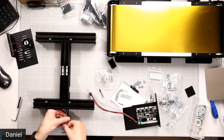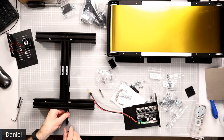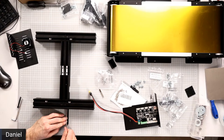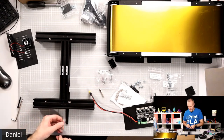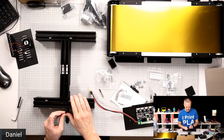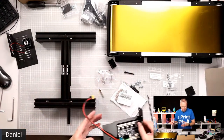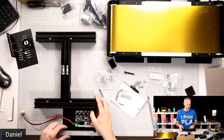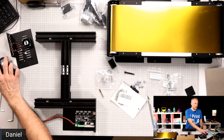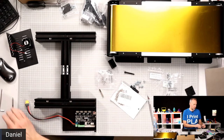And that's why it's important when getting this kit. I never checked every single detail of the Ender 3 versus the Ender 3 Pro, like if every single screw is in the same position, but it seems there are slight differences, and it really makes a difference. So if you're getting this kit, that's what Andrea told me, it really is important to know exactly your printer version because of these tiny differences in where this is to be mounted. Otherwise it just doesn't fit.